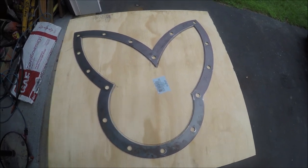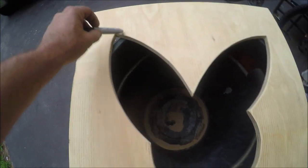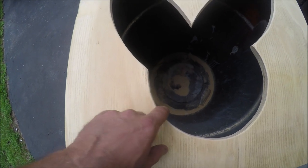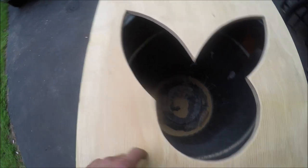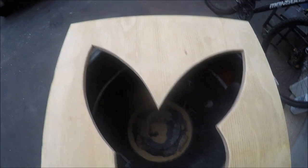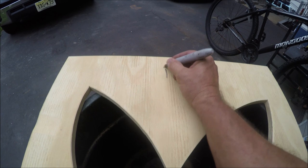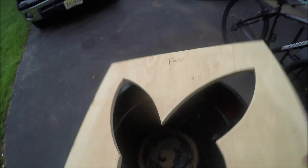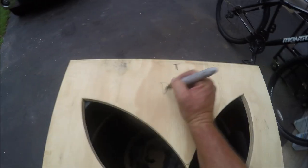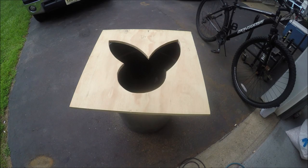We got it all cut out, went through, and sanded all the edges. In the last bubble video I actually routered the edges, but there's really no need because the bubble doesn't start till it's like a half inch in, so sanding is just fine. Because these windows are not symmetrical, I'm gonna label them. I want my ear to point forward, so this is gonna be the passenger side. When I go to blow it I'll have to flip it over, so on the driver side the ear will face forward — I'll just put 'driver' down. Now we're gonna cut some plexiglass and get ready to blow.